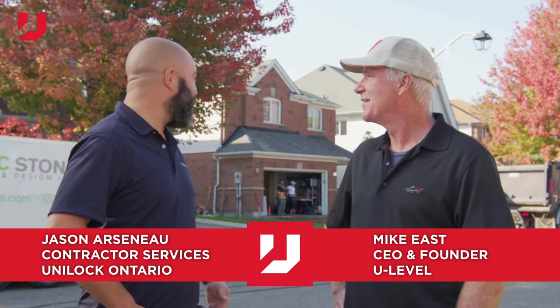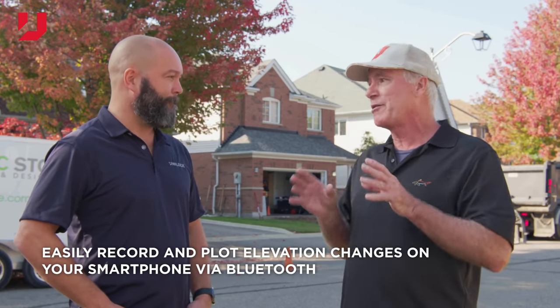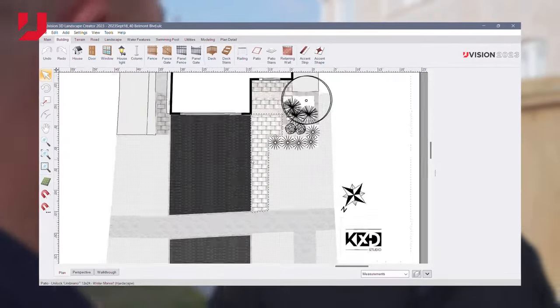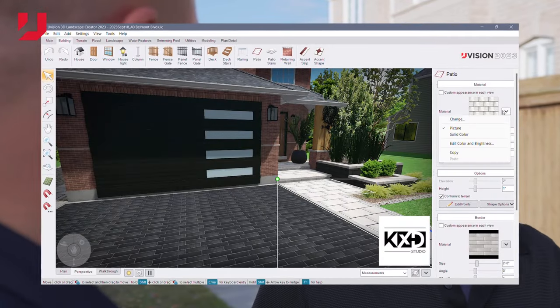Hey, Mike, we're back on site at this driveway project and the excavation has started. Yes. We were here doing a survey earlier. Is that the end of the U-level for this job? Oh, absolutely not. Whenever you connect the U-level with the app, that's where some of the really cool magic comes in. So we actually map the site, we upload that into the Uvision program, and we design the site from those ground elevations, which getting the ground elevations into your design program is usually the very difficult part. And with the U-level, it's kind of standardized.